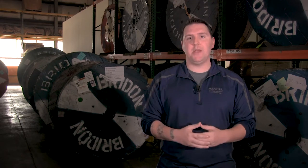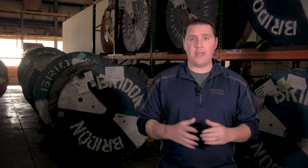What can you, the customer, do to make sure that you are as ready as possible for the installers when they get there? There's things the customer can do to make this process go smooth. If you know you have a safety program that everybody needs to go through, you can have that set up with the safety guy. Have doors free, clear of equipment. Any areas that need to be cleared out, make sure they're cleared out. If you need to have work permits or hot work permits, have a guy set up ready to handle that. Have everybody aware that that area is going to need to be worked on that day and that everybody needs to be out of the way. And you can come up with a plan on how you're going to load equipment, unload equipment, and stage all your product during this process.